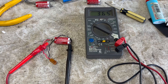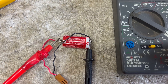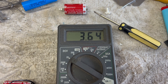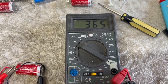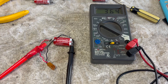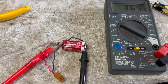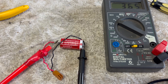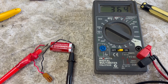This last battery I pulled out is the Z-axis battery. I've got my voltmeter probes on there and you can see here we're getting roughly the required voltage that we need. So fortunately it was just the X and Y axes and not the Z. Had the Z dropped its memory, that's a whole other heartache because you'd have to realign the tool changer and set all those values. So thank God that didn't go.